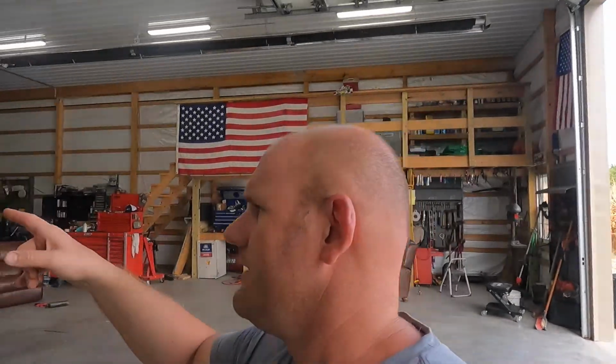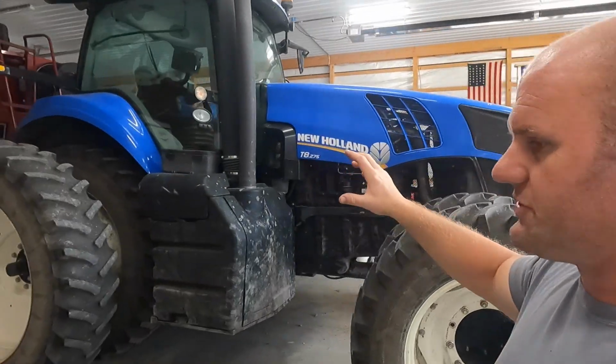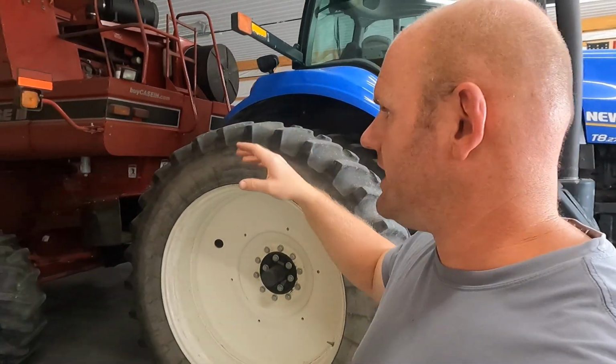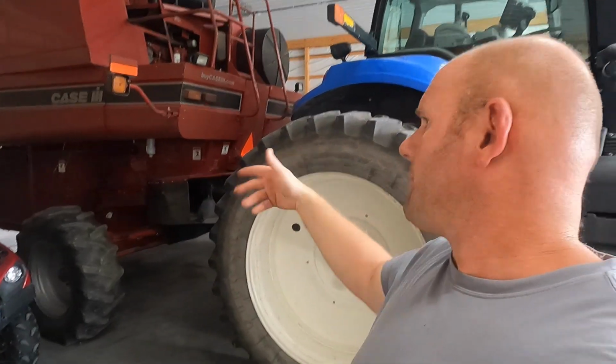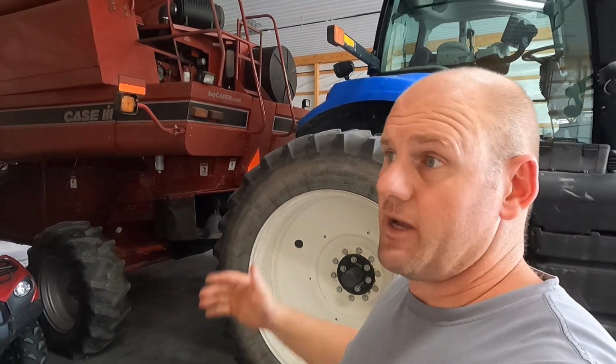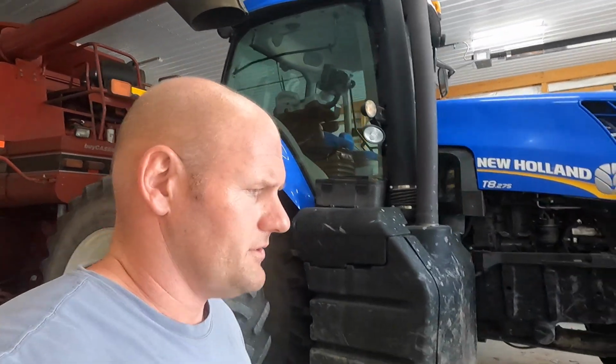That'll be in the next video, I think, because also in the next video, I've got to set our combine up for corn. Everything's still set up for doing wheat, so I've got to do some changing of the rotor settings, change those vanes back to fast in the back of the rotor. Do a couple other odds and end things to it, nothing too major, because everything else was done before wheat harvest, so the combine is pretty much ready to go other than making some adjustments. And I'll go get the corn head, put it on, and we'll be ready to get rolling. So hopefully in the next video, we might even shell just a little bit of corn. Get it ready. I'm excited. It's here, finally. Start seeing some of our hard work get turned into actual green stuff, cash.